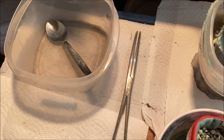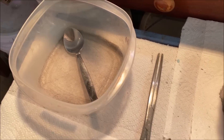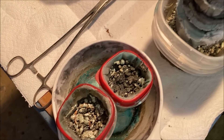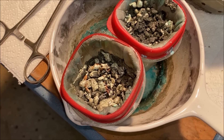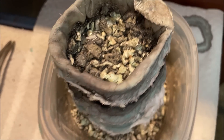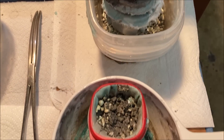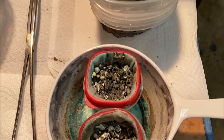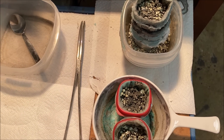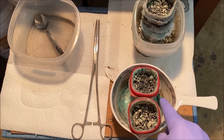I think we started out with about 8.5 kilos of impure silver to feed into the silver cells, and I've gone through all of that — these are the filter changes. There's a little bit of undissolved impure silver shot left over in these filters. We'll process the slimes in these filters and recover all the silver that didn't get dissolved, plus there should be some precious metals in those slimes such as a little bit of gold and platinum group metals.